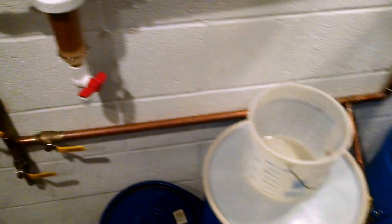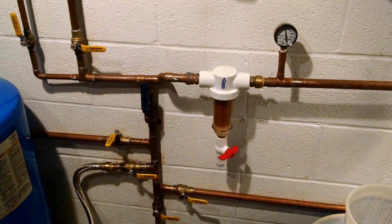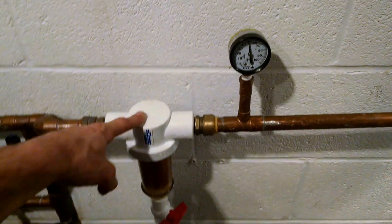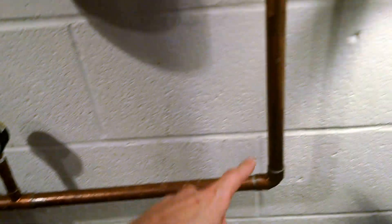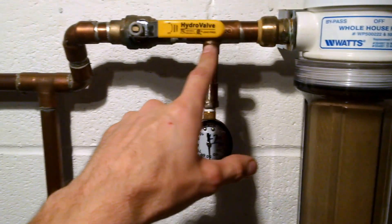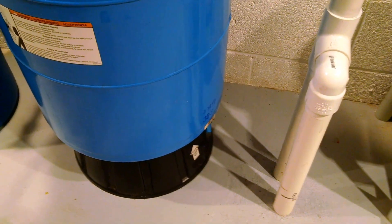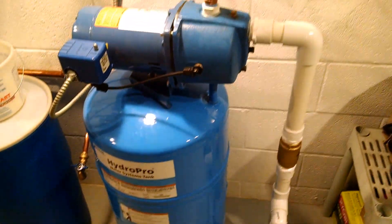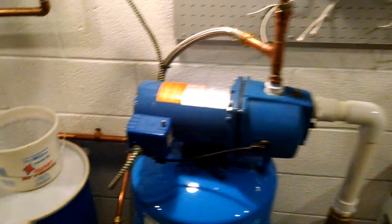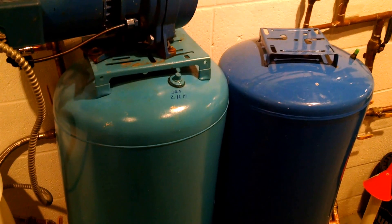So if I open this up, I can use this pump and this tank to pressurize these other tanks. This tank and that tank are already in line with the whole system in the house. Then all the water would go through this filter system — which is a 250 mesh, 60-micron spin filter — and then it goes into a 5-micron sediment filter, and then a 5-micron carbon block filter, and then it goes off to the house. So you can choose between the well, which is right here in the basement — a shallow well going down about 8 feet, so about 13–14 feet from the surface — versus the rainwater system. Either way, either pump can operate to pressurize any of the tanks in the system.